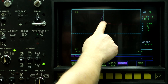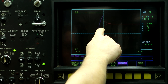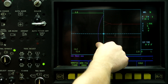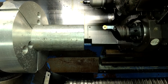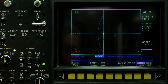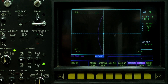The tool is described as a boring bar. However, the tool geometry will not show this huge radius we have on the tool. So when this is cutting, it's going to look like it's cutting into the part slightly. But for right now we're ready to go and hit cycle start. So let's back it away from the machine, hit cycle start. Turn on the coolant and let's hit cycle start.